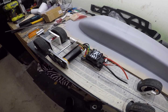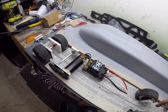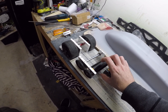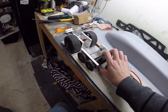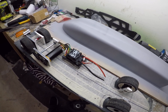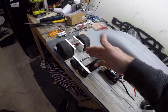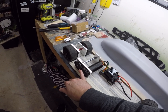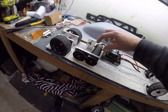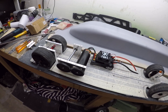That's where I've got a little bit of concern. When I designed this system, I have some gearing here, but the pulleys were going to be one-to-one — so a 40-tooth, which is bigger than 40 millimeters, that would allow the belt to go above and below the motor. So it'd be plenty of room to reach the front. To get everything to work with one-to-one ratios, these had to be big gears so they could actually touch, because this has to be far enough away from a pretty large pulley to get that belt over the motor.